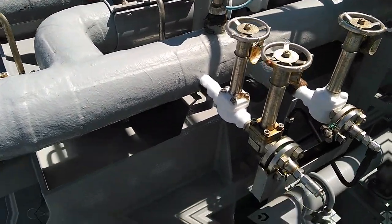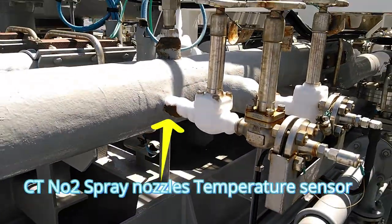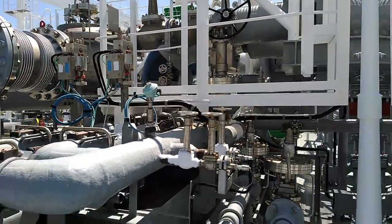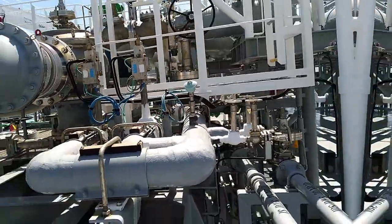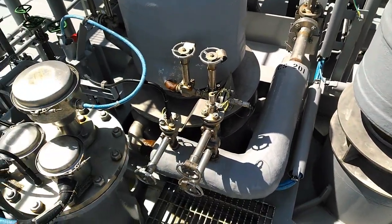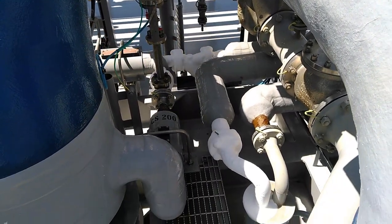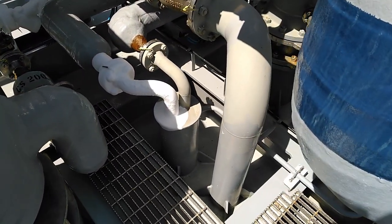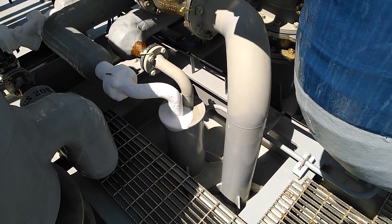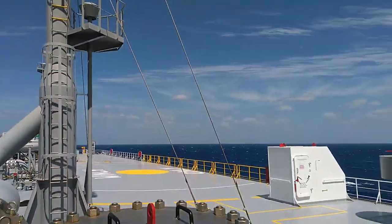Remember that the liquid dome has to always be dry — without water inside. This is the temperature sensor showing the temperature of the LNG passing by. During the operation we need to check that there is no LNG passing through the return valve or through the discharge valve of the spray pump. Here we only see LNG passing through the port side railing piping, so everything is good.